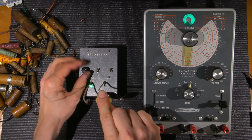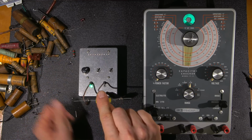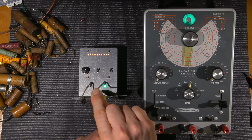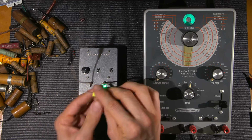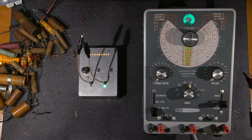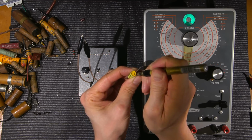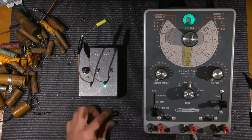So this is an adjustable sensitivity setting for all sorts of different capacitors, and it also has an intensify position here for those really, really sensitive ones that you're having a hard time locating the outside foil on. You can see how clear that is, right? So outside foil, this side. Then what I would do is take this capacitor and my little fancy pen, if I can get the cap off, and put a little dot here, just like so. That little dot now indicates the outside foil end, and this is marked for use.